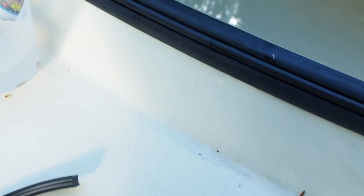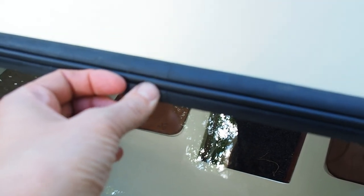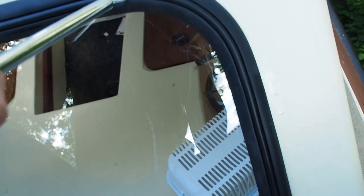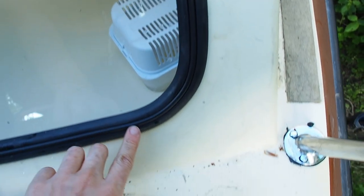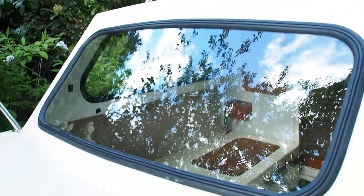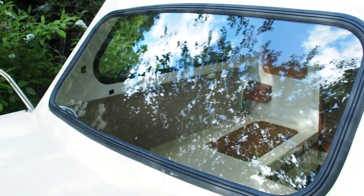This is what it should look like in the end — a very clean finish. You can barely see where the two ends join, and I'm really happy with how it came out. You'll want to go over the whole thing and look for parts where it didn't quite go in. You can either use your fingernail to push it in, or if it's a little stubborn, use your glazing tool and gently push it in to make sure it's as seamless as it gets. Here is the final result — doesn't it look so good? I'm going to try to find the before shots and insert them here. Hi Oscar, hi!